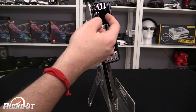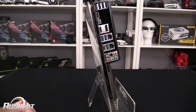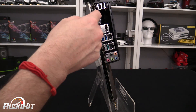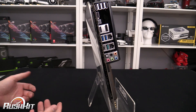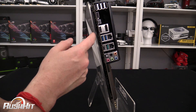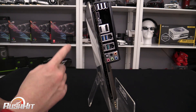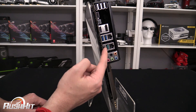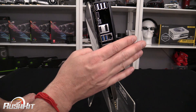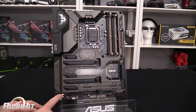While we're around here you can see four USB 2s. There is another USB 2 here that you can actually use for BIOS flashing — the direct flash — so you can flash the BIOS on the board without even having a CPU in there, which is pretty nuts. Then we've got HDMI and DisplayPort. We have dual Intel Gigabit LAN, two USB 3s, two USB 3.1s — these share the same bandwidth, but you do have a Type-C and a Type-A connection — and then your audio.